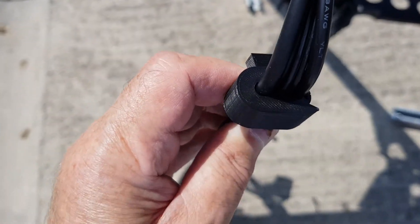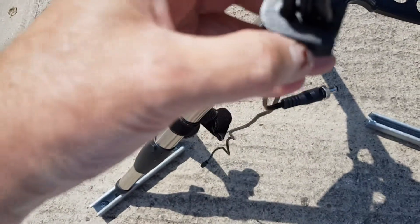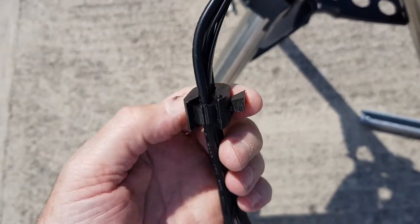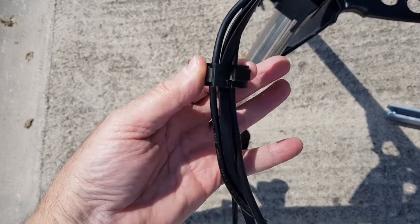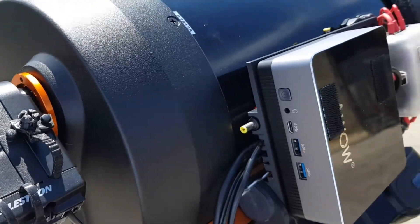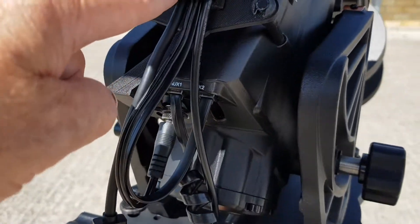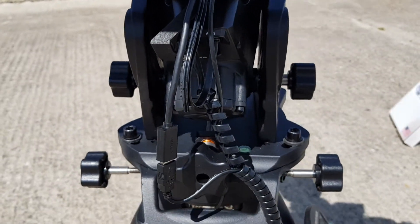In order to clamp the additional cable, I've had to amend the little clamp components. The two flat cables are now one on either side, and I've beefed up the clips to make them even stronger than before and increased the size of the dovetails for the same purpose. I'll now attach these and the bridge piece on the back of the mount and get the cabling sorted out. Here's the focus motor wired up — the wire goes down into the wiring harness, then down to the bridge piece and into the auxiliary ports. We've just got the single DC power to the mount and all the electronics — that's the only connection.